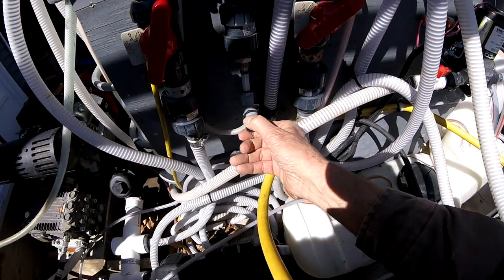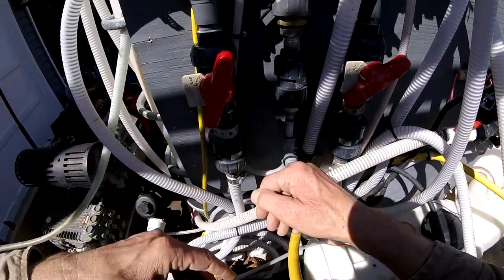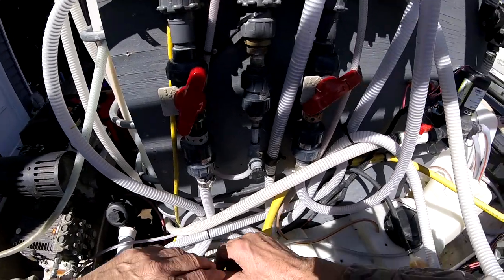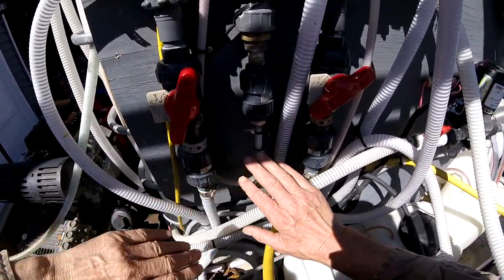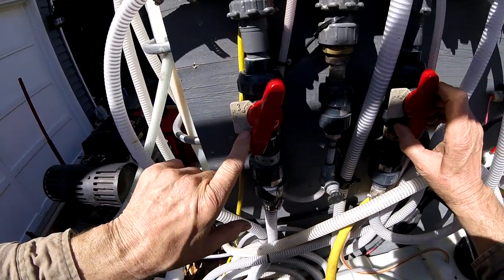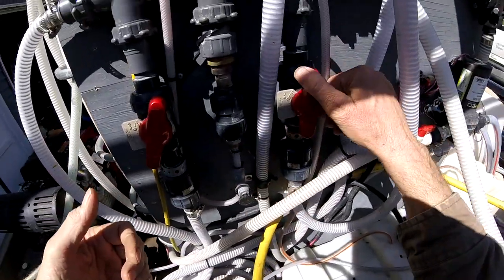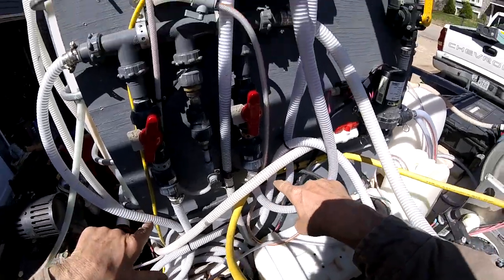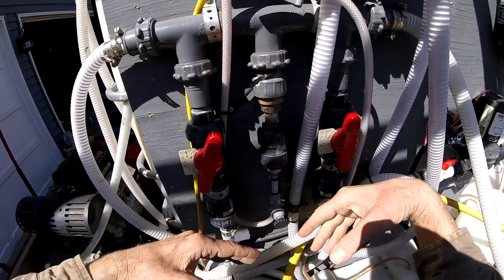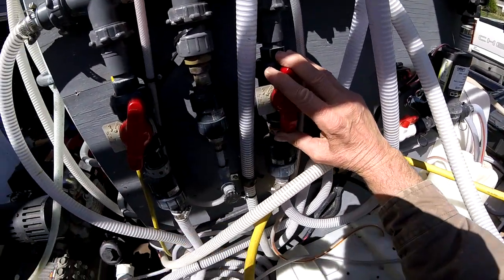I wouldn't even worry about the soap — I just barely turn my soap on. I'm using less and less soap the more I wash houses, probably almost nothing, just maybe a quarter turn. That's a needle valve, so just barely any soap through. Let's take the soap out of the equation so we don't complicate it. If I know it takes 80% of one valve open to be a perfect baseline for my pump — everybody's pump is going to be different, even if it's identical, because of how many fittings, the height, the water level. You always want to maintain a good vacuum in here, and it will help everything pull evenly.